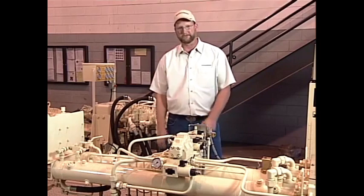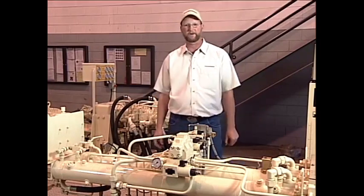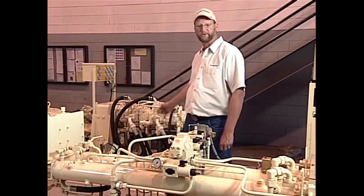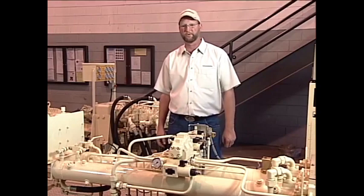This entire system completely controls everything you see here for concrete pumping. With an electrical signal and a low pressure hydraulic signal, we efficiently move our drive cylinders and force concrete into the boom pipe system.